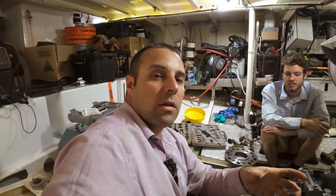We've got a lovely six-inch stainless exhaust but it doesn't fit the new engine, so we need to make a couple of mods so the new turbo lines up with the old pipe. The anatomy of this exhaust: it bolts to the existing exhaust at the back end of the engine room, comes along the roof, then drops down through a flexi-joint onto the original turbo. The original turbo used to face the back of the boat and fire exhaust rearward. However the new turbo is the other way around, so we have to do a complete 180 with this setup. The new turbo also sits quite a bit higher, so we may have to do some interesting geometry with the pipe to get it to fit.